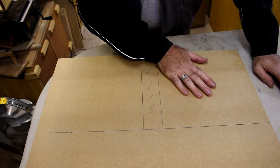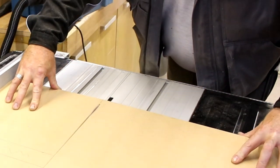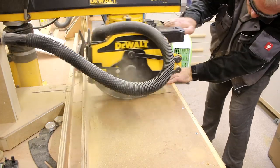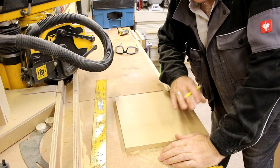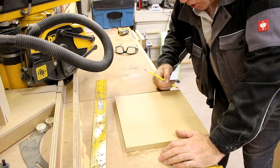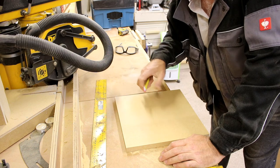I'm just going to get these two panels cut out. One square is going to equate to two 90 degree angle clamps. What I'm going to do now is cut from corner to corner at a 45 degree angle across — this is going to create two clamps. I'm going to get this done now at the radial arm saw.